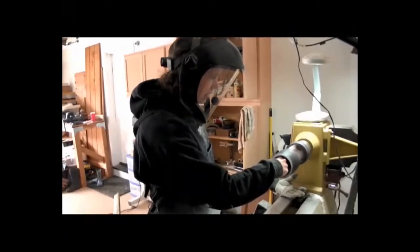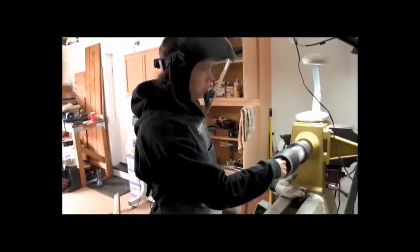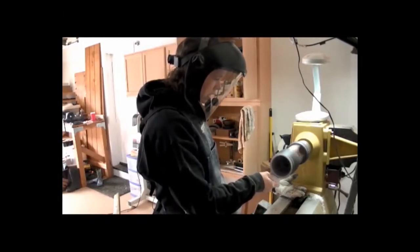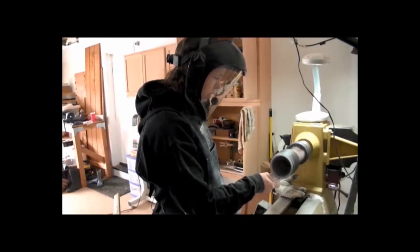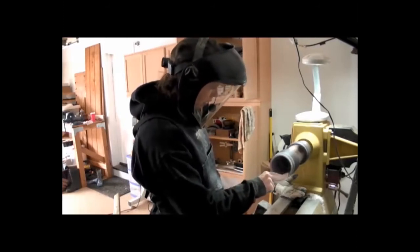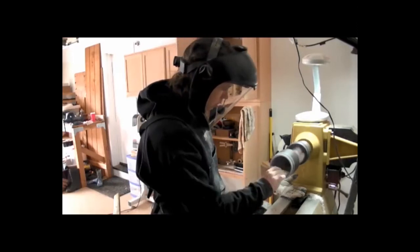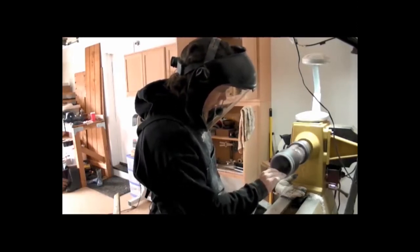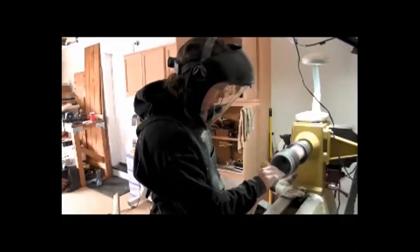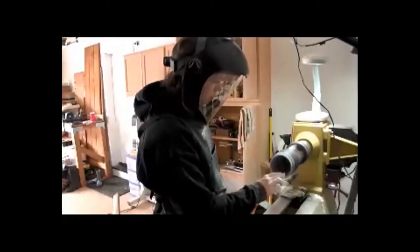And he said you can get rid of that if you want to take the time, sand it all down again, which I did, and then put a sanding sealer on it. And then put your finish on it. And it just came out beautiful, came out great. And that was exactly what I needed to understand, was that step. But really, different wood products and different woods, that's one of the parts that I had to really wrap my head around, all the different finishing types, whether it was oil based or water based, and what you apply with each type.